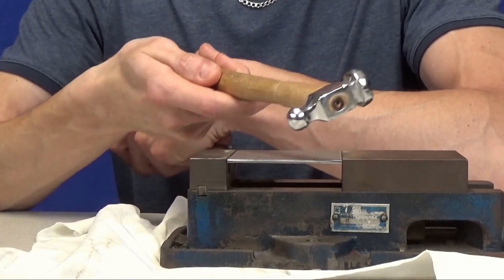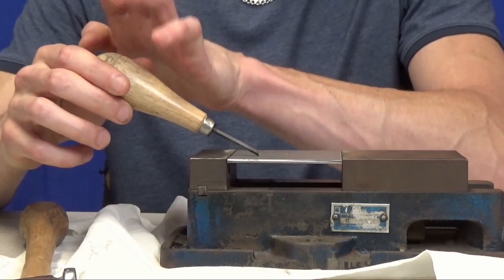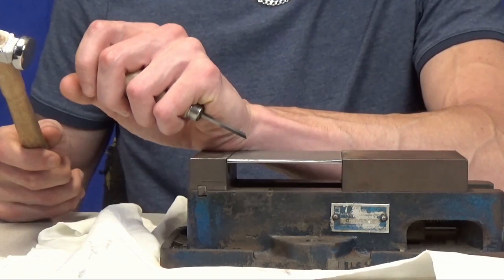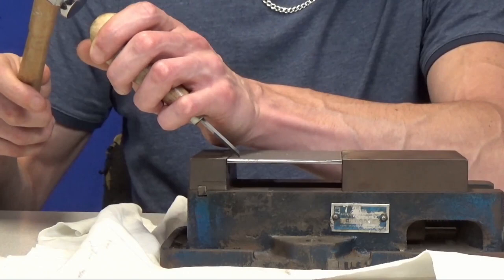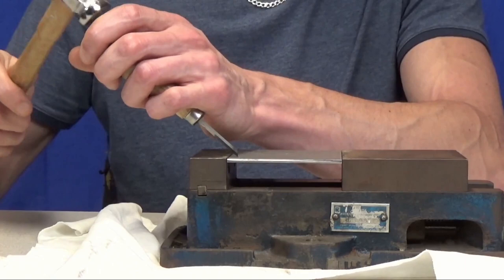To check it you need to know at least the basics of hand engraving. Hold your hammer like you would any hammer, and with your graver you want the pointy part pointing down at your metal. Grab the graver with whichever hand you're not holding the hammer with. You don't want to push it or force it into the metal — just apply enough pressure to keep it in place and let the hammer do all the pushing. To start a line, begin a bit higher, tap it a couple times, and once you've gotten into the metal a little bit, lower your hand and keep tapping to maintain your line.